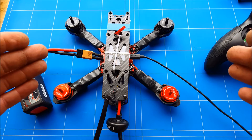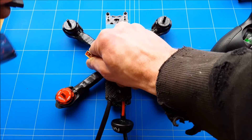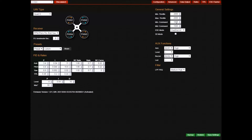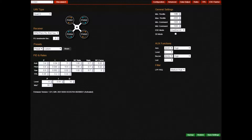Just remember: to disconnect your battery again, if you want to save anything in the KISS GUI your battery needs to be disconnected first. Now you can turn off the radio. We are ready to go back to the KISS GUI to make further changes. Back at the computer, put the value back to 1050, press save, and always double check that it's correct. Set arms to AUX1 high.